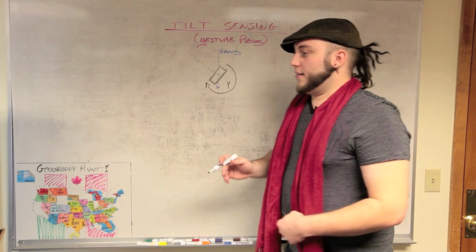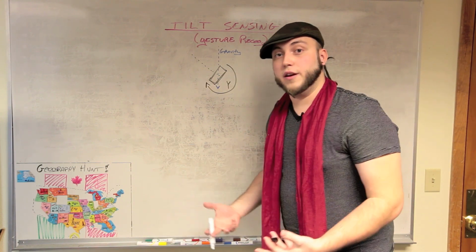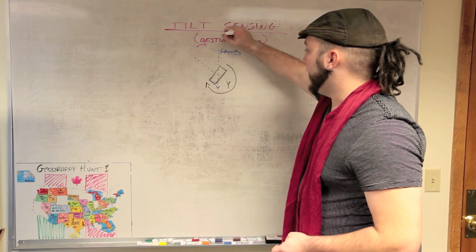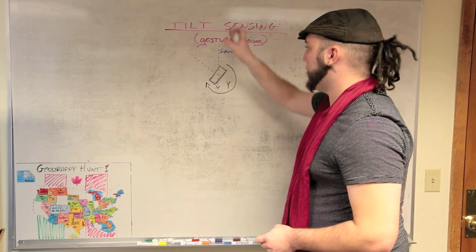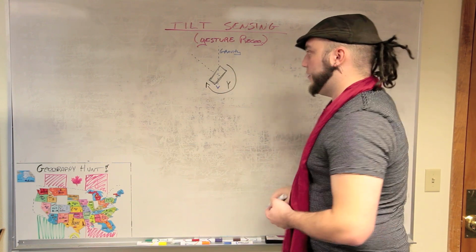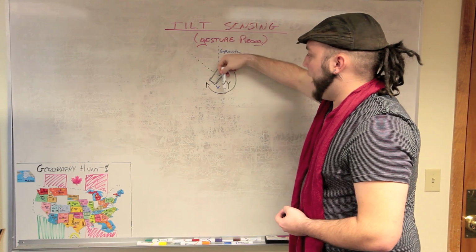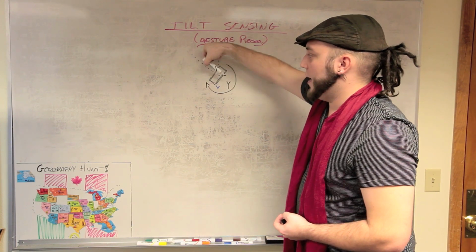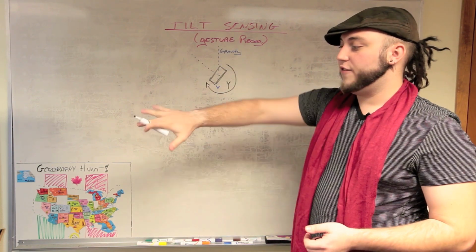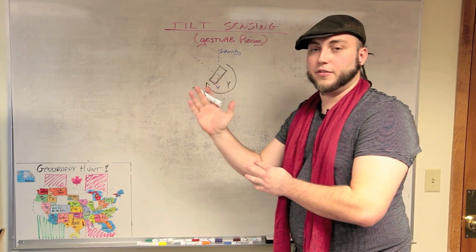And the reason that you get this when you tilt it is because an accelerometer obviously measures acceleration, and we're all under constant acceleration due to gravity. So acceleration due to gravity kind of comes down through the center of the device. You can imagine as a line that sort of points down straight towards the center of the Earth through the device. And so if you rotate the device relative to the Earth, then your acceleration due to gravity is going to be off axis with that imaginary line out of the top of the device, which produces a reading. So you can tell how far tilted something is by telling where the constant acceleration of gravity is coming from.